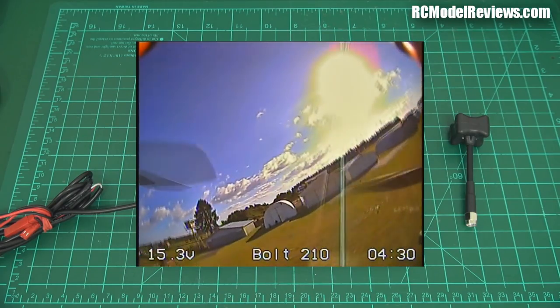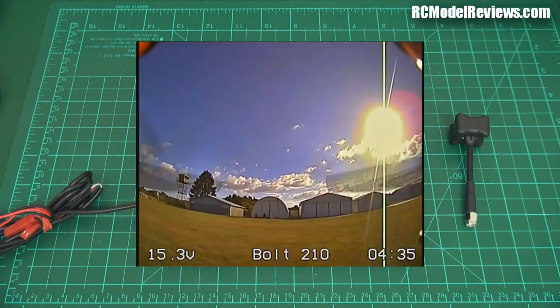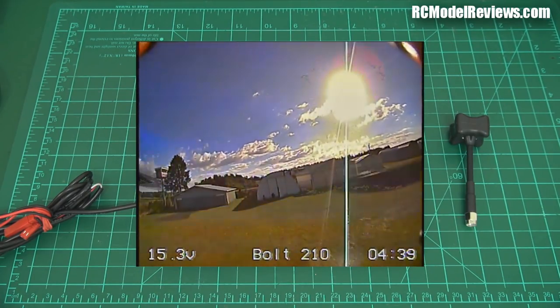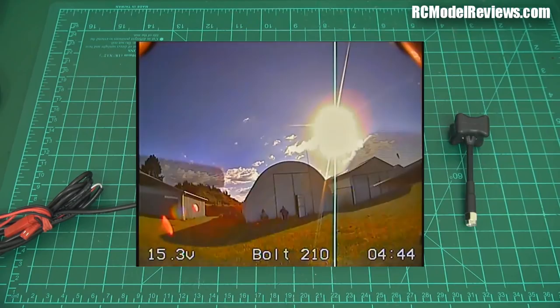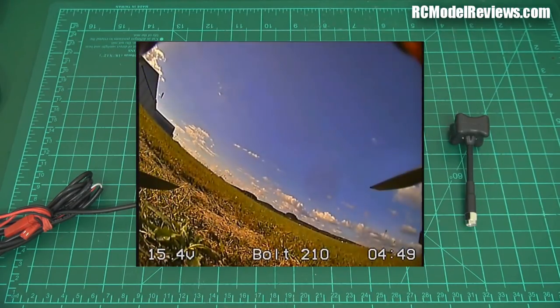Come in for another landing, if you can call it a landing. Again, notice we're getting a bit of multipathing right in front of these hangars — a lot of signal bouncing off those hangars. The axial ratio really shows the importance of that when you're dealing with reflected signals from metal objects, like you'd get in a car park or flying around large buildings. And there's me and my observer. Good landing, eh?